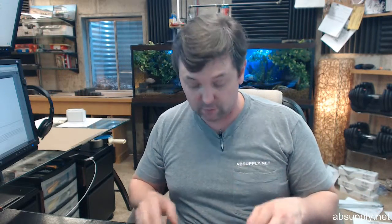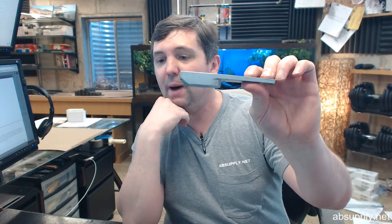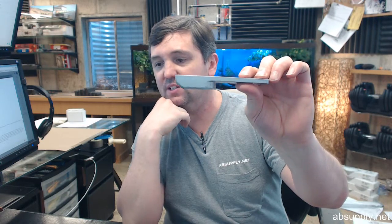This material can be used with an end load or a side load arm, but this is certainly an end load arm. Used with 1 inch deep bottom door rail applications and is the standard bottom pivot set supplied with C.R. Lawrence's S and A type packaged door closer. You could be looking at an overhead concealed door closer from C.R. Lawrence, and this will be the bottom portion of an S or an A type. 1 inch inverted bottom channel.